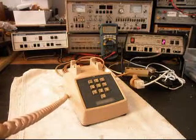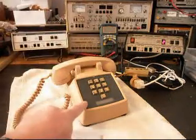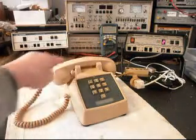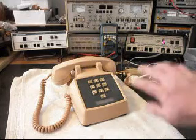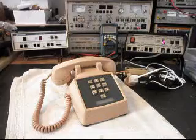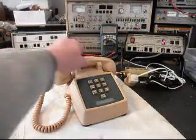One, two, three, four, five, six — hello, hello. So we know that this telephone is ringing in on a ring cycle, it's dialing out, it has receive and transmit. I can push this button on the switch box and that totally takes the analyzer out of the situation and gives us a line out. And we can call a time and temp number, so we'll go ahead and do that. We'll give you some dial tone.